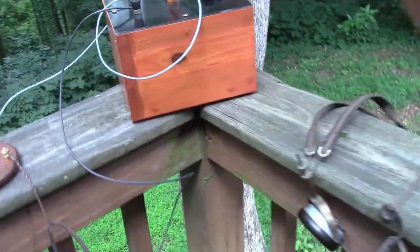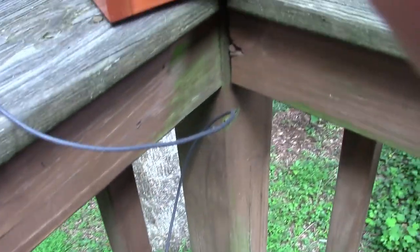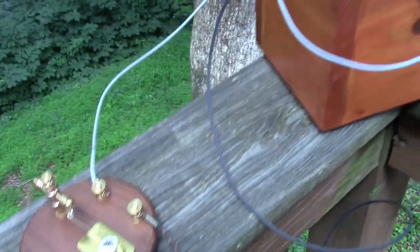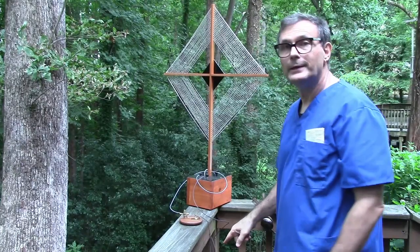And I've tied my headphone to the ground, the other side of it to the detector. It's looping through that antenna. It's coming back out of the antenna, and I've hooked the other end of the antenna ground to that ground as well. So my antenna is grounded,